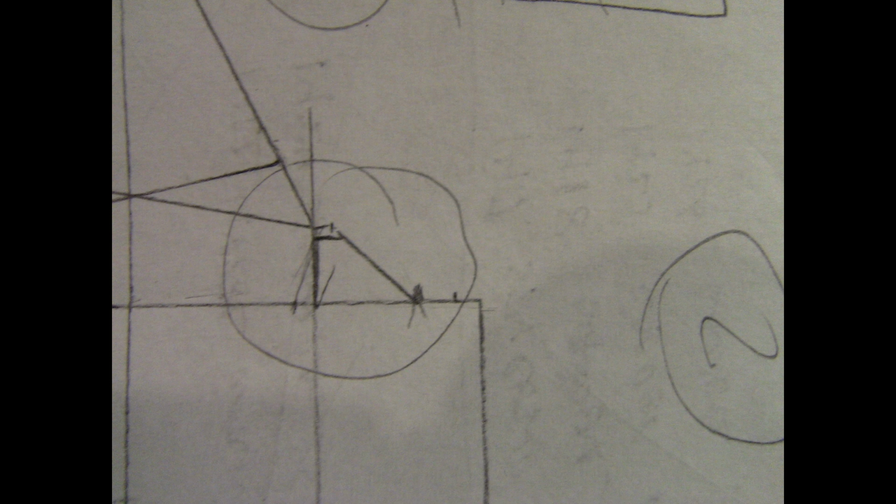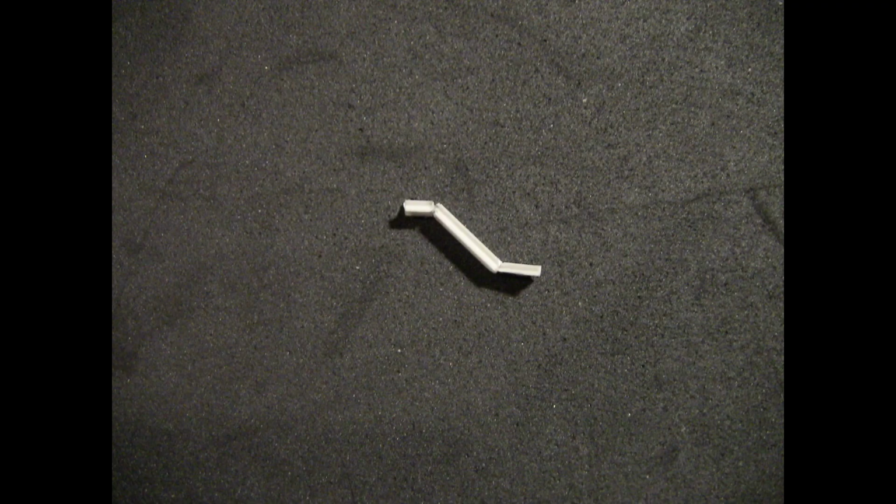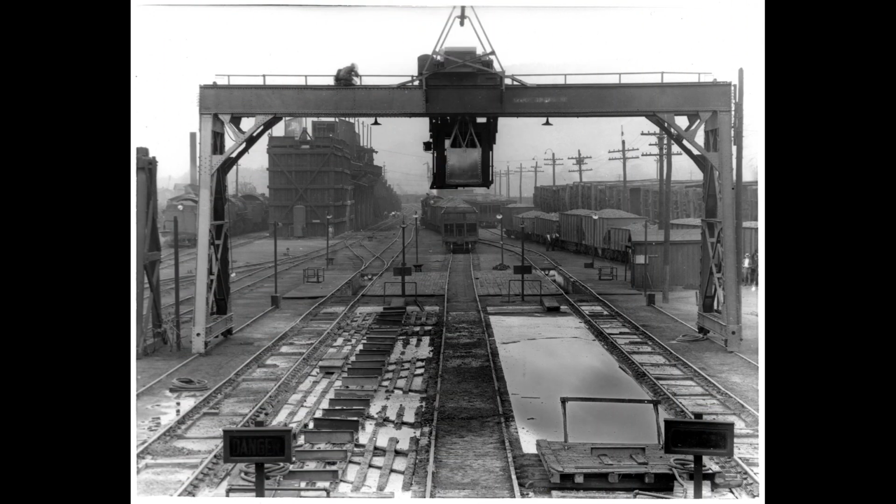Now there's also some angle side bracing on these, and this is I-beam and it's cut and welded on the original, so I found some I-beam that would work for that size, and I just go ahead and cut V-edges out of it, and bend it to where it needs to be bent, and then I have my extra braces.